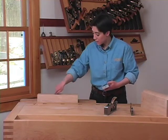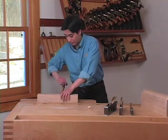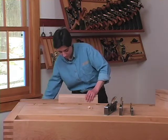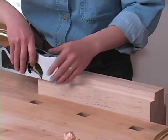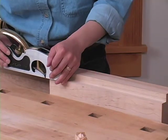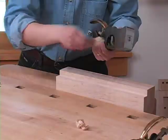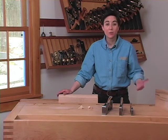This is a thicker shaving because at this point I'm trying to bring that groove down, so I'm taking off extra material when working a groove. For the long grain of the rabbet, I'm going to go ahead and use the large shoulder plane. The large shoulder plane will come out along the rabbet and has lots of mass in order to take off the material. I'm going to go back to my right-handed grip, fold the bronze cap into my palm and use my left hand to help guide the front of the plane. This is just a small sampling of the types of joints and work that you can do with the shoulder planes.